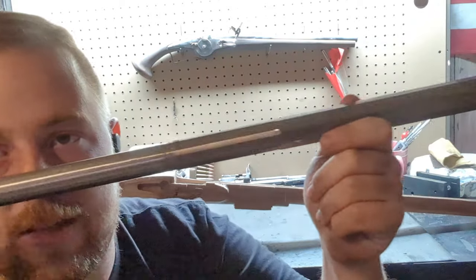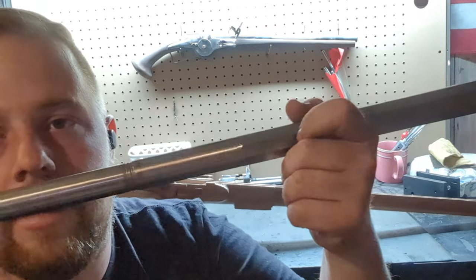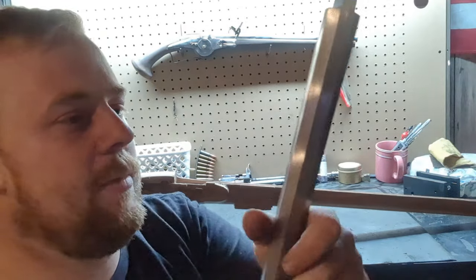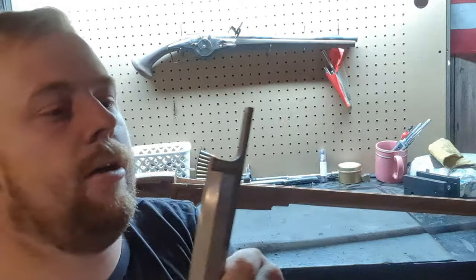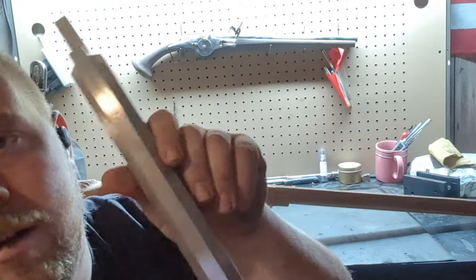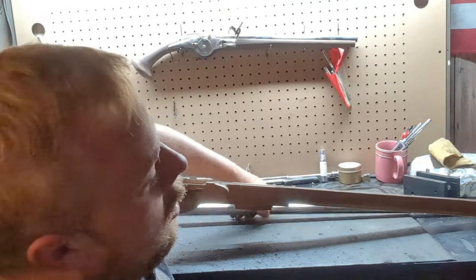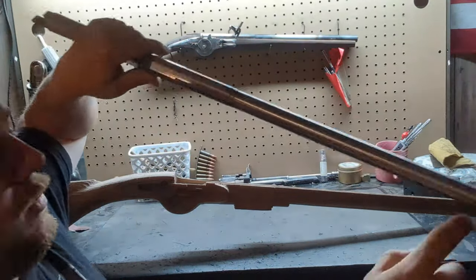Here's our barrel — the lighting is not the greatest, but you can see our octagon cuts. I'm going to have to work on them with a file a little bit. Got the wedding bands. This one I believe is a 62 caliber — I think — I haven't measured the bore out. I made this order in March of last year, so it's been over a year. There's the Colerain marking on the bottom of the barrel. You're going to be doing a lot of draw filing. And also, you'll have to silver solder on your loops on the bottom of the barrel.